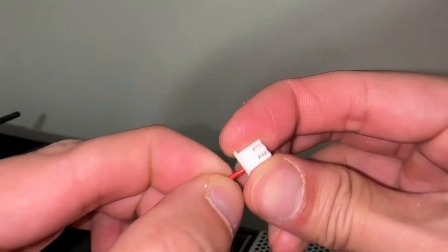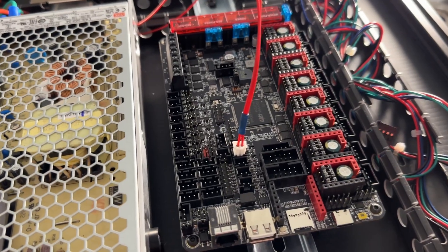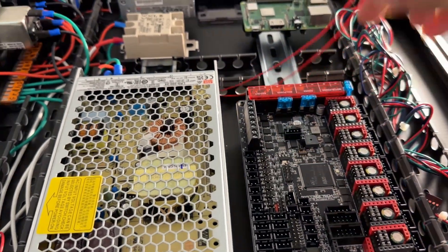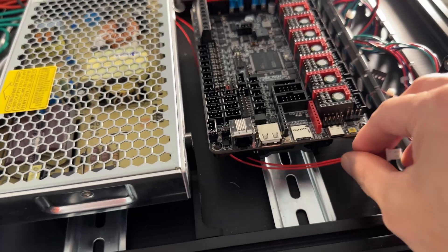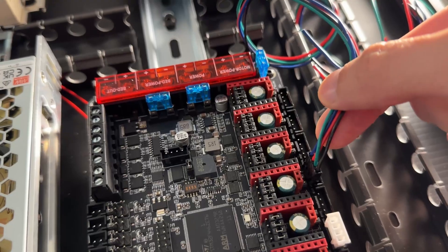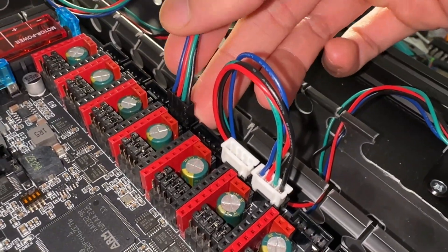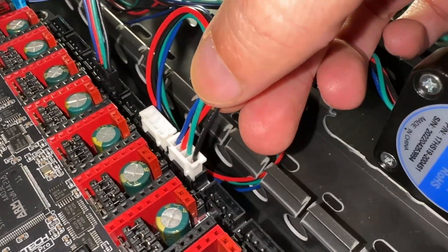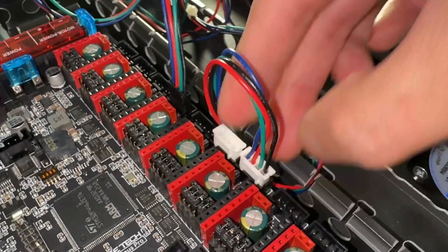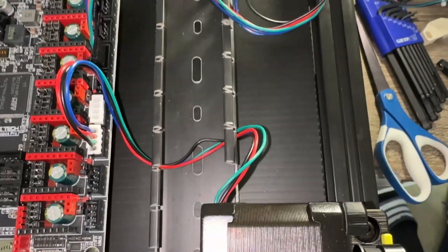A tiny screwdriver can really help if the wire is too thin to go in without bending. If you are going CAN bus, you can leave the wires disconnected from the controller until we flash the firmware later. Now that we know how to crimp, let's clean up the motor wires. They come with Dupont connectors which can attach in two directions. Based on this reference, the motor wires should be facing this direction if using the stepper online motors. This can be inverted in software, so just make sure pins 1 and 2 are paired and the same with 3 and 4 — they each control one winding. Test for continuity if unsure.